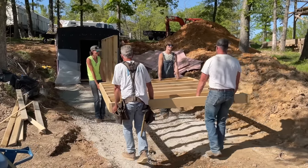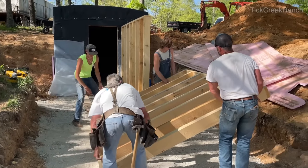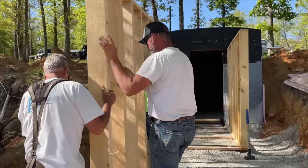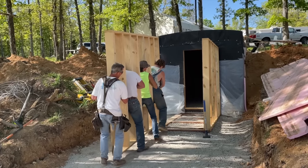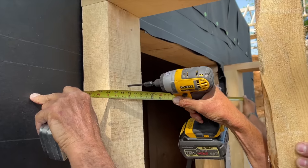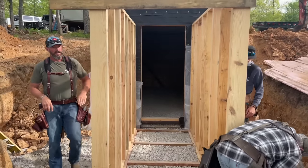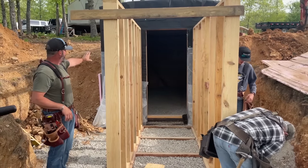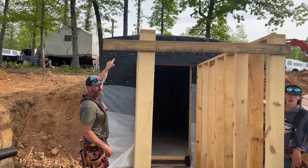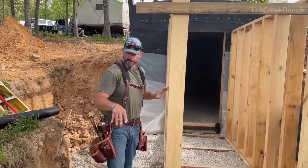What you see here is the framing for what we call the hallway. The hallway gives more coverage to the front of the building — more protection and better temperature regulation. We anticipate this potentially blowing away in a strong storm; we don't want it to cause damage to the front of the building by tearing away with leverage and force. We're cladding the outside just like the main building. The dirt line will be about a foot over the top of the structure, and a short retaining wall will finish holding that soil.